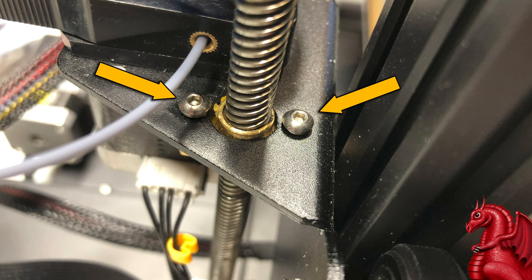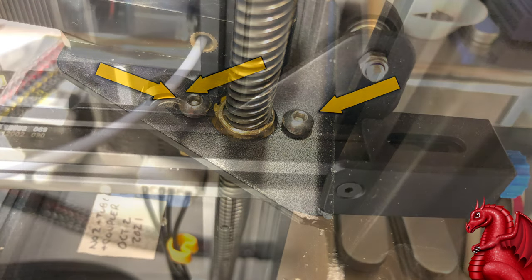and make the Ender work normally, and you won't have any more issues with Z-axis binding. This one, I recommend everybody do, whether you are experiencing Z-axis binding or not. Keep these 2 screws, if you're not having any issues, about 1.5 turns loose. If you are having some issues, keep them about 2 turns loose. I do this on all of my machines, and it really helps a lot.